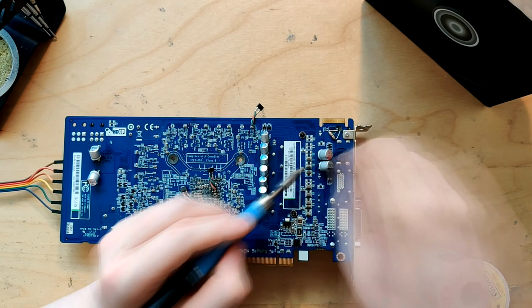So my idea is that if I can't fit a lot of these, I'm just gonna use super high capacitance and hope that they just do something. So yeah, that's the mods for now. So quite a lot of stuff. So I will put the stock heatsink back on now and take my scope shots, and then I'm gonna put the entire thing sub-zero and see what I can get in terms of scores.